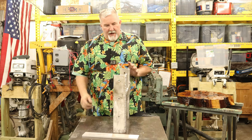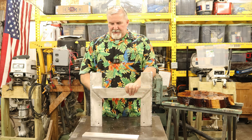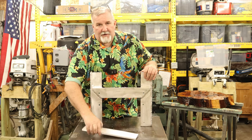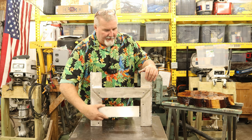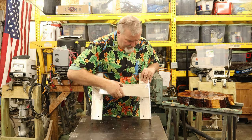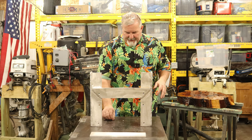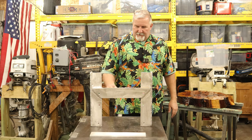So, all right, next steps are going to be clamp this bad boy to the transom, drill some 3/8 holes all the way through. You know, we got to commit here. And then we're going to cut some more of this plate stock. We got this one here, we got some pucks down here, and then we got the inside pieces. This is going to be 1, 2, 3 inside pieces. Why? Because I didn't make this wide enough. We're adding pounds to the back of the boat is what was going to happen here. But that's okay. These are pounds that a 16-foot extra-wide John boat can more than handle.